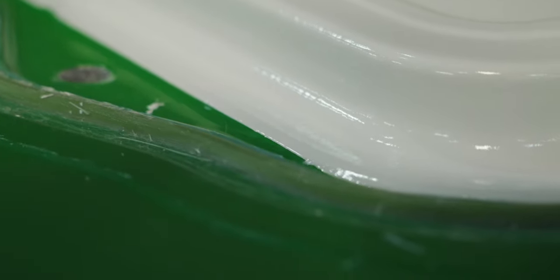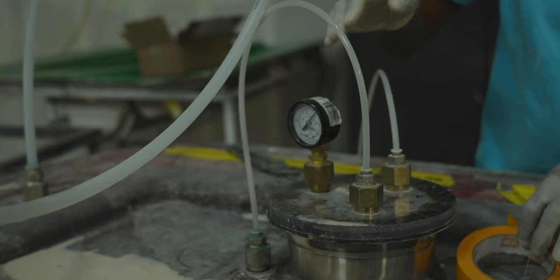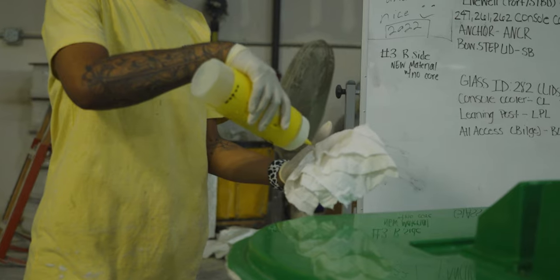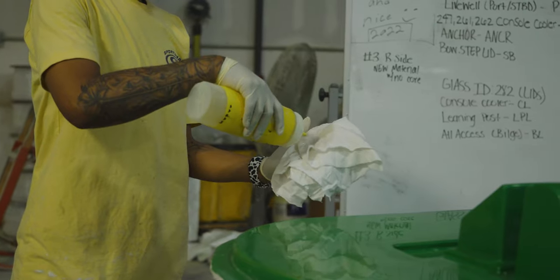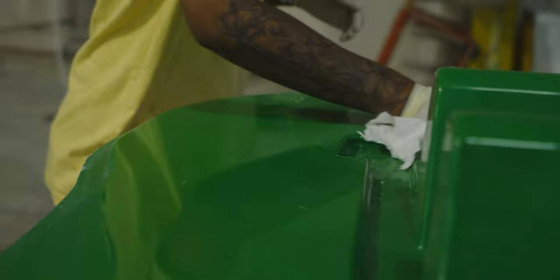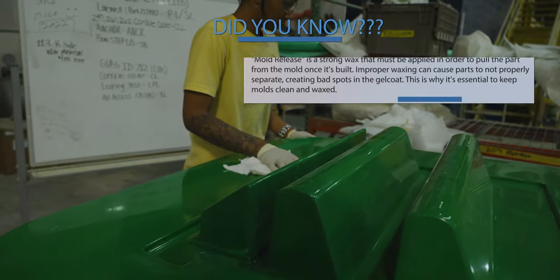On top of the double gasket design, there are special ports strategically installed that will serve as vacuum and resin ports. The manufacturing process of a light RTM part begins with a quick cleanup, followed by getting the molds coated with gel coat. The molds are first prepped. This includes a cleaning to remove any dust, as well as a coat of mold release if needed. Some areas will also get masked off.